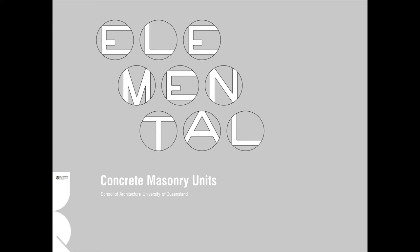Concrete masonry units are perhaps not used decoratively in the same way that clay bricks are, but they're quite ubiquitous for a lot of basic structural work on medium scale buildings, simply because it's a fast, effective, and pre-engineered system. It relies on a monocoque-type uniform structure where reinforcement is embedded inside the blocks and the hollow core is core filled to make a very strong reinforced concrete block wall.